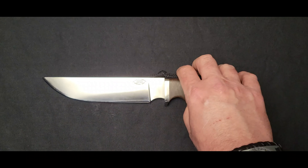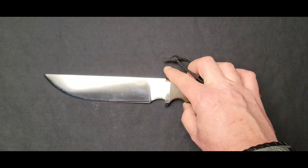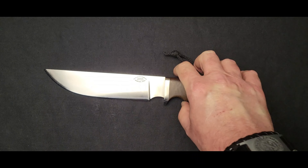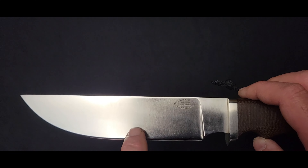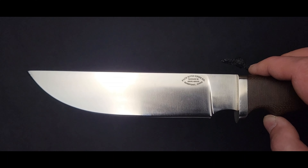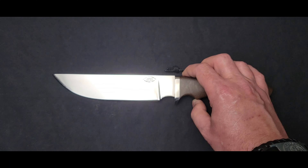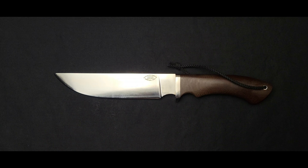Then we move on to the spine, which is the flat portion on the back of single-edged knives, and then we move to the grind or the bevel. These can be represented a wide variety of ways, but your three most common bevels — first off, like this one here, a flat grind, which is a singular plain grind from the edge to the spine. It doesn't always have to go up to the spine, but this is dead flat — a true bevel as though you were looking at the side of a very, very pointy triangle.